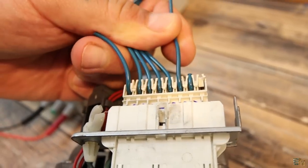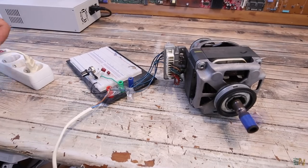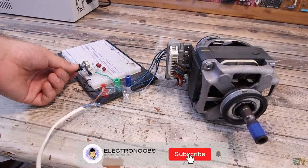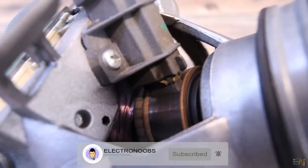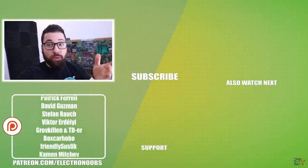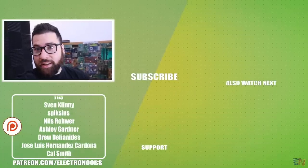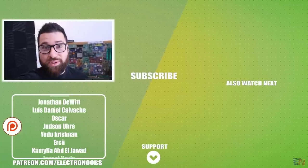That's how you can control this universal motor with both DC and AC voltages. You now know how it works, the internal configuration, the wire connections, and all the schematics — which are available in the description below. If you have an old washing machine motor, you could build an electric saw, a drill, or many other projects — with AC it has a lot of power and is quite efficient. The main downside is brush wear, requiring periodic replacement. I hope you learned something new — consider subscribing and leaving a comment. Also check out my merch and t-shirt shop in the links below!